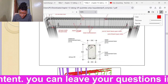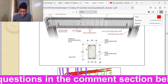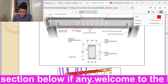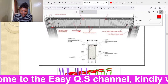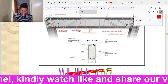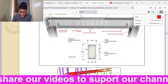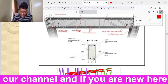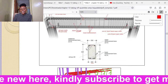Now the detail in the beam, this one is the stirrup. If the beam is 250 millimeters wide, we usually have the reinforcement inside there. We are shown how the reinforcement should be curved, should be folded. This way, the stirrup, we usually bend that reinforcement. We are shown that the width of the beam is 250, so the width of the reinforcement bar is 200, because the reinforcement bar should not be seen outside the beam. There should be some cover.